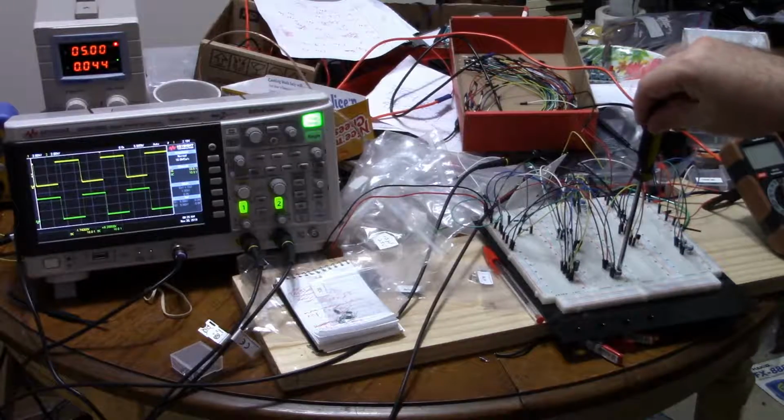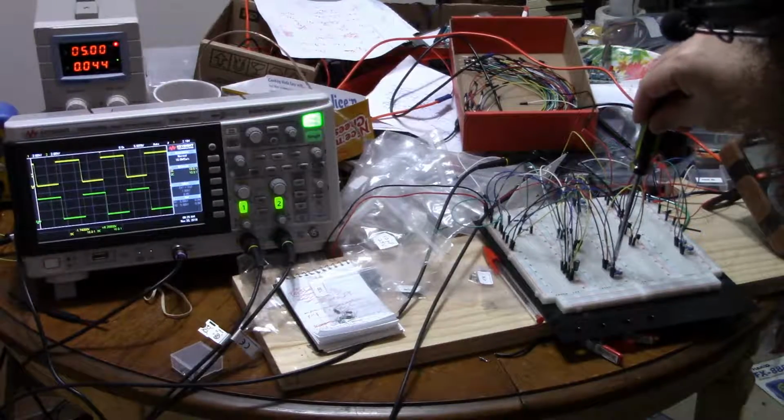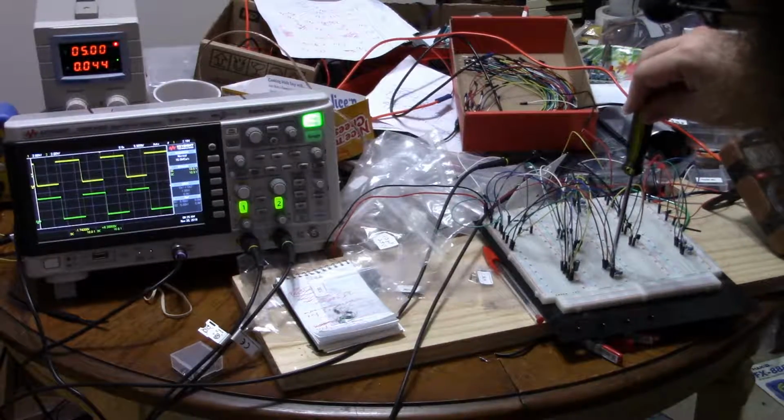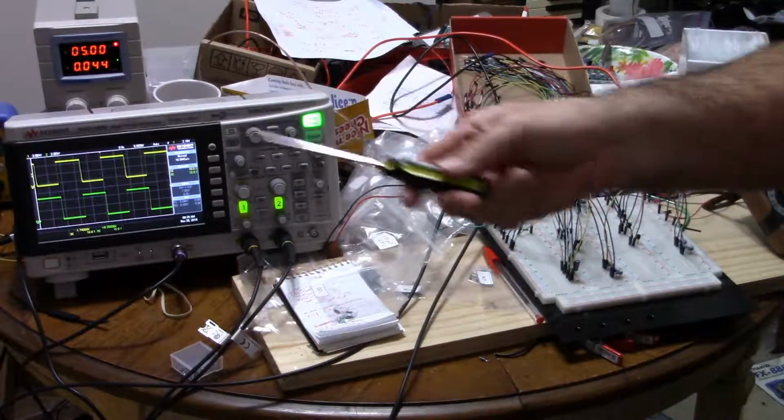So let me turn it down just until the point where it's visibly affecting it. So I'll wiggle it carefully, and then I'll wiggle the other one. We'll go down, down, down, until about there. You can see it wiggling, so I'll turn it up a little bit. And now we're back down to about 44 milliamps over there, like it should be.